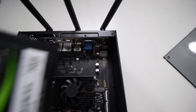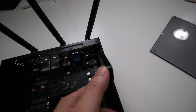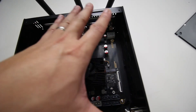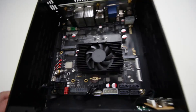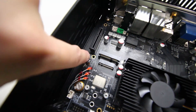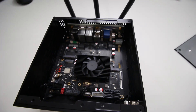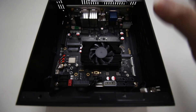In the case itself you could squeeze a hard drive onto the side if you don't mind it sitting loosely. Otherwise, you can get a bracket that goes on top to host a two-and-a-half or three-and-a-half inch drive. A few other connections I didn't mention: there are reset buttons — you do need those to flash with the SD card — and there are also pinouts for mic, audio, and line out. Just judging the size and what you can do with this board, it makes for a very good server SBC.